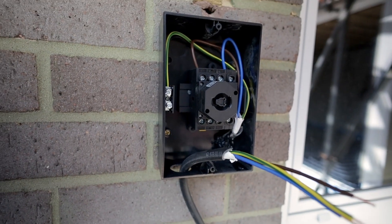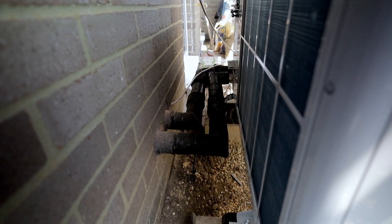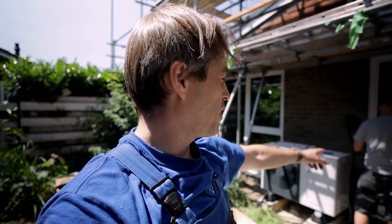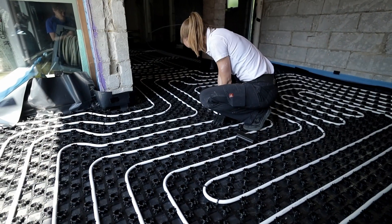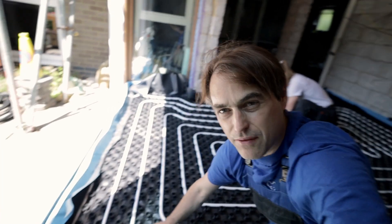The heat pump is already in place and Simon is wiring it — we've got primary pipework insulation on the primary pipework. I know you're looking at the unit thinking this doesn't comply — those are non-openable windows below the level of the unit, and only windows above about 200mm above the unit open, so yes it does comply. Marie is clipping the pipes by hand because the clips don't fit the gun, and we only have 20mm insulation below, which makes it really hard to clip.